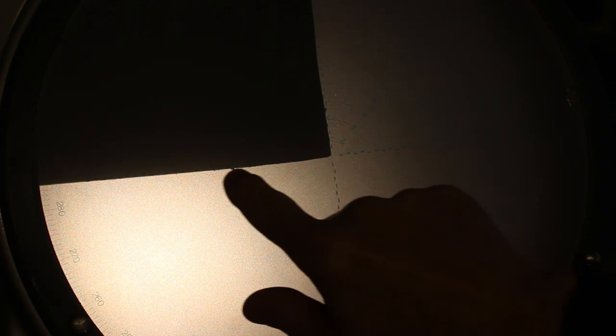You can rotate the bezel until we're square with it. You can probably just see the cutter is not straight — it's actually bent, and that's because it's worn out on the tip. If you look really closely, the actual corner is rounded off slightly. Looking at the other side, this one is in even worse condition — it's not flat at all and the corner has been rounded off. That tells you immediately that this cutter is finished.